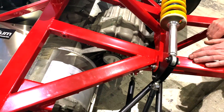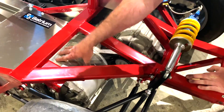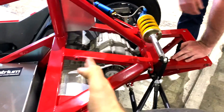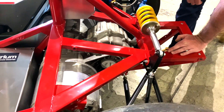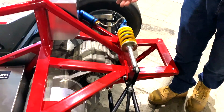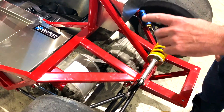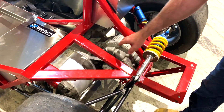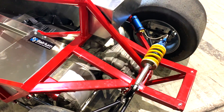The reason for flipping it is to increase the handling characteristics. We needed the weight in front of the center of the rear wheels. The way to do this is to flip it upside down. We then need to crack the case, run an external oil pump and reservoir because you can't run the oil pump backwards. By the time you flip it over, the sump is here for the oil pickup, so you actually have to bypass it completely.